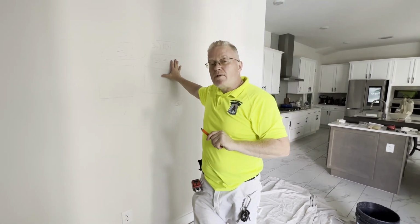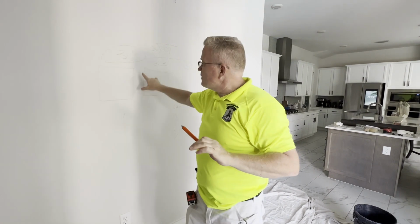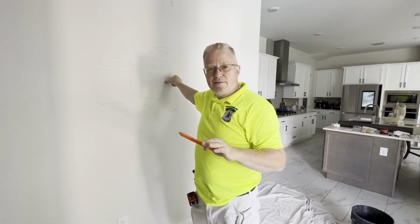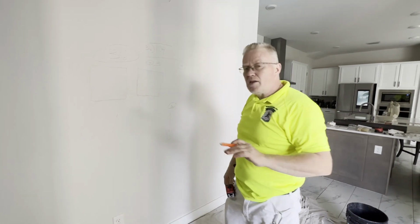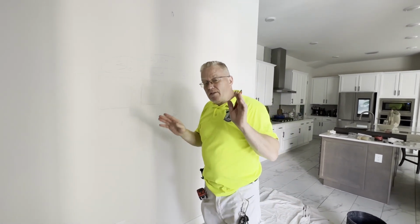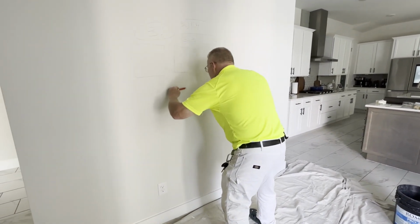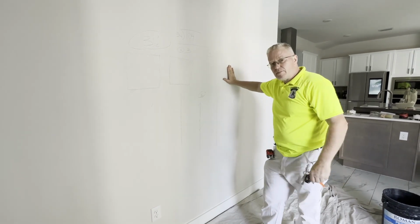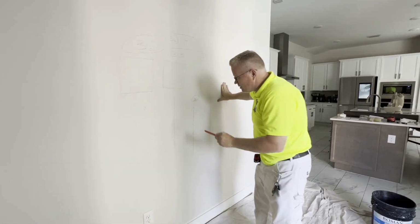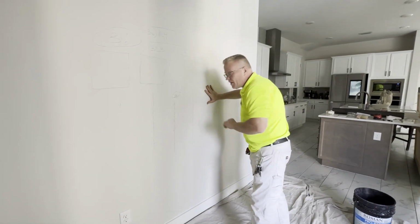Let's say our number were 4. What's the difference between 3 and 4 besides 1? 3 is odd and 4 is even. Here's a secret. If after you divide your number is even, the layout is going to be dead in the middle. The edge of your first sheet is going to go up against the middle. The edge of your second sheet is going right up against the middle.